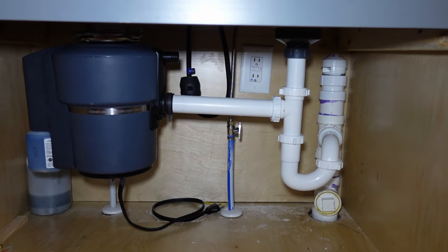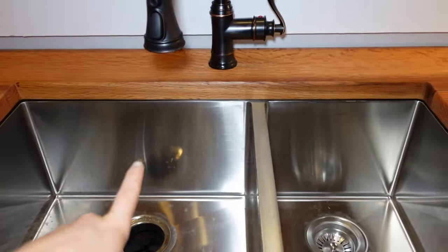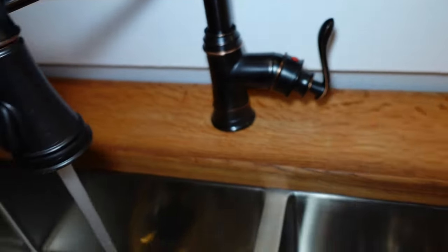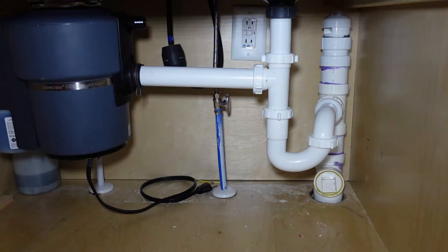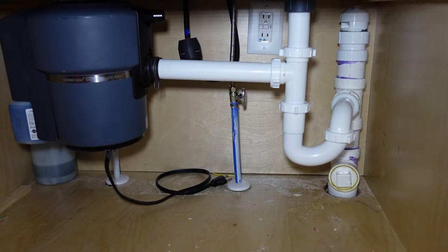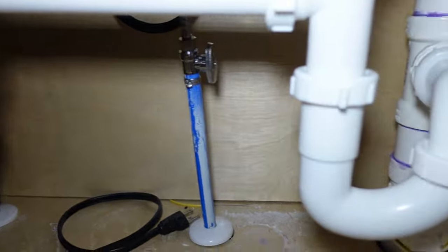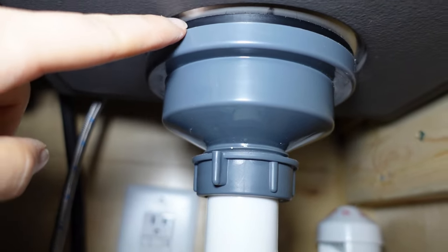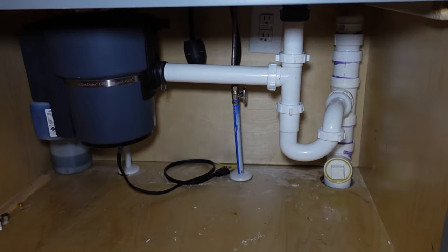So I have all the plumbing finished. The next thing I'm going to do is test it out — I'm going to turn on the sink and let it run a few minutes on each side. I let it run a few minutes on each side and everything looks good. You'll just want to check each of your joints and make sure there's no water dripping, and also up here at the top of the sink flange as well. But everything looks good — that's how you plumb a kitchen sink. Thanks for watching.